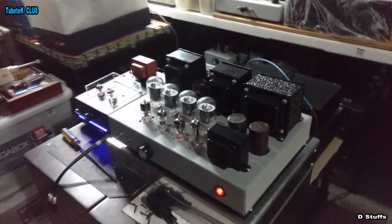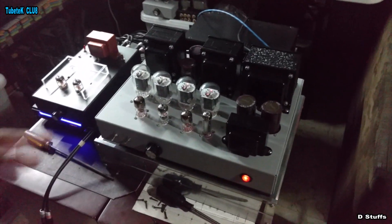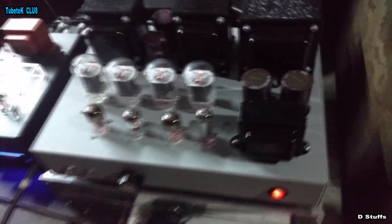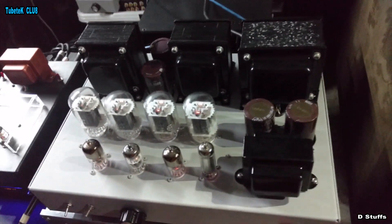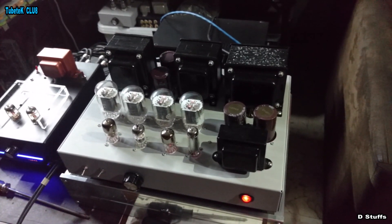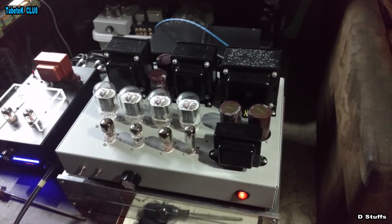What's not immediately noticeable with this amp is the generous filtering used in the power supply. The brown capacitors are 1000 microfarad, 450 volts, so the ripple voltage is very low. I also apologize that I cannot show you the live performance of the vacuum tube from Master Tony - the Tube Tech - because again the music we'd use is copyrighted.